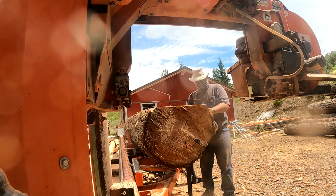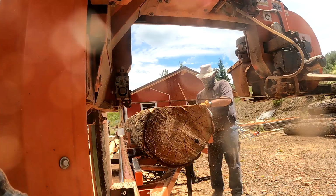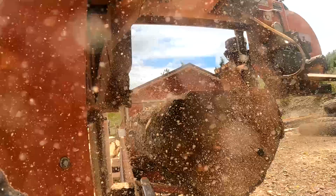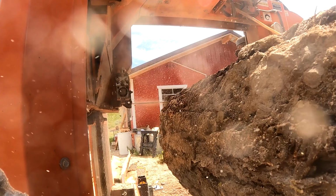And you can see with that side support there that the shape of the log isn't all the way against the side support at the bottom. That's key. I've got 2 or 3 inches that I can sneak this over. So I get it milled down enough that I'm still going to have clearance, but I can push it over those stops on the side.